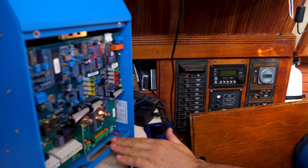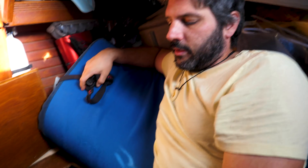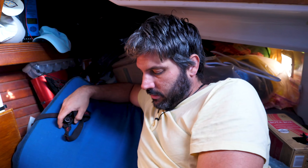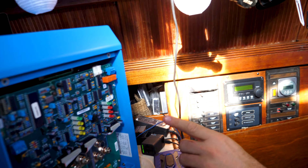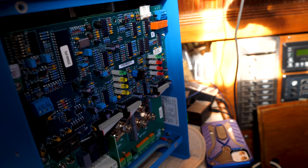I'm hoping I can avoid installing the soft start. This Victron has a 6000-watt — six kilowatt — surge rating. I think our air conditioner is rated at seven kilowatts. This one has a transfer switch, so as soon as the inverter sees input from the generator or shore power, it closes off the inverter function entirely. This one also has circuitry that allows it to combine generator power plus its own battery inverting power — it's called power assist. The startup load is like a quarter second — just the electricity needed to get the compressor turning over — then it drops to about 1200 watts running.